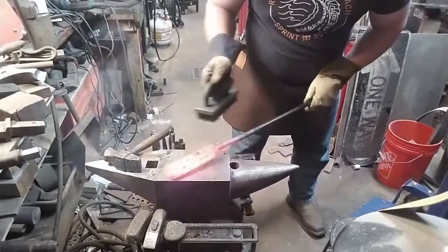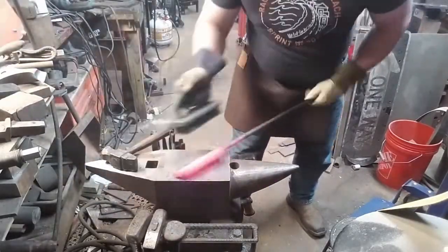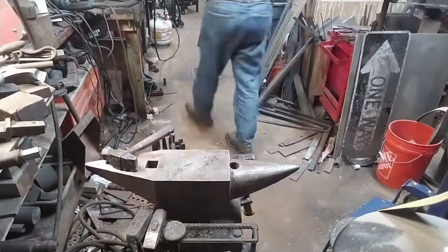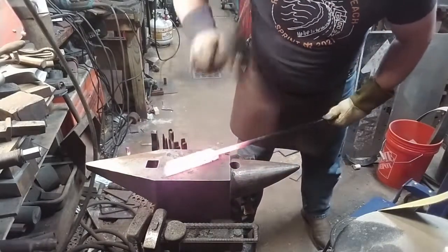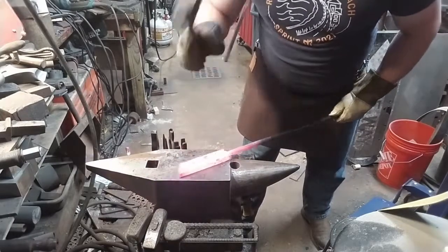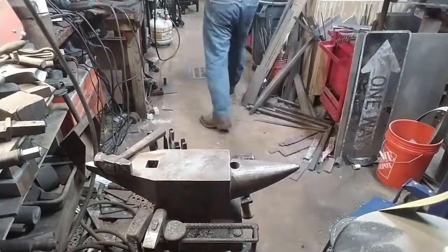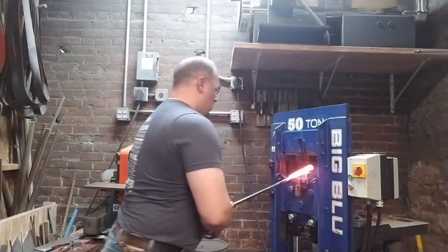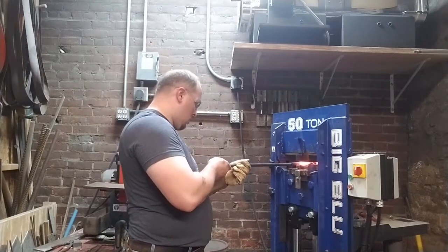And the reason for that is because of the mechanics of diffusion welding. All fire welding, all forge welding is a species of diffusion weld. And diffusion welds happen when the atomic surface, or the atoms of the different surfaces, diffuse and mingle together to such an extent that there's no longer any difference between the two surfaces. And that's really a function of heat and pressure and time.